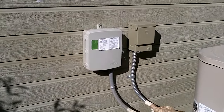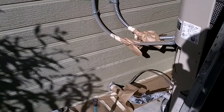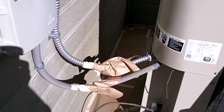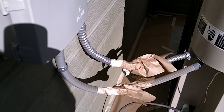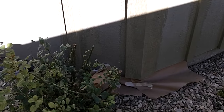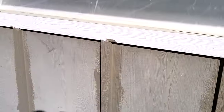Electrical fixtures we don't mask because we want to paint them so they look the same color as the house and blend in. Then we've masked behind the air conditioner and did some masking so we have a nice crisp line on the conduit fitting. Masking around downspouts that go on the ground so they'll be painted and blend in. Put masking on corners where it's hard to shield. Got a hose bib here — we put masking around it so we don't get overspray on it.